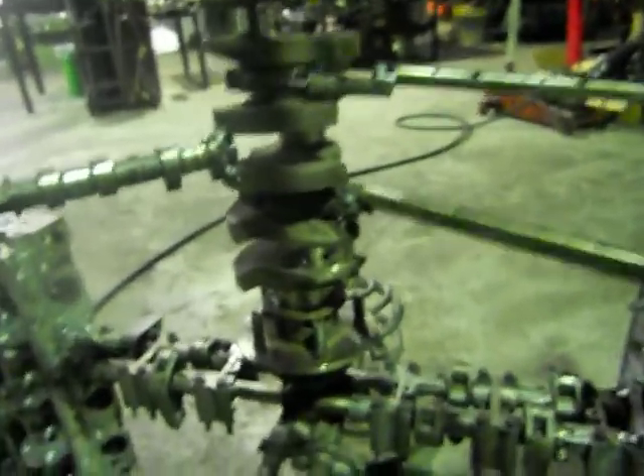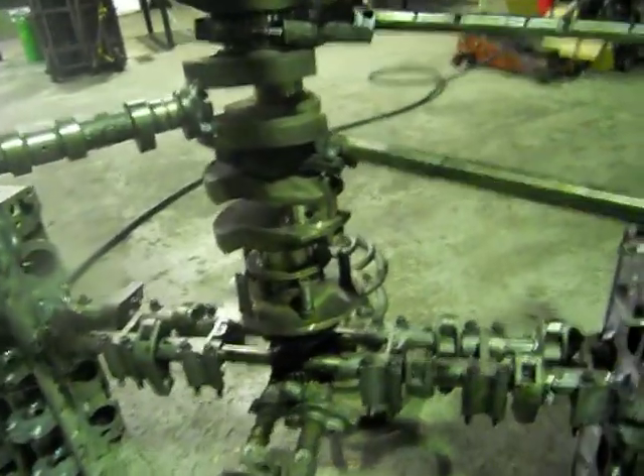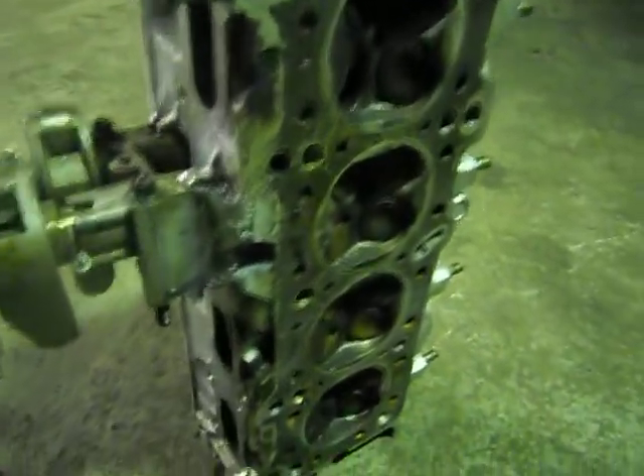Because it was bloody heavy — this thing weighs over 200 kilos I reckon, which is about 400 pounds — it started getting a bit uneasy on the springs. So I had to then run another rack gear, that's off a Falcon. All I've done is just welded a couple of caps on the heads there and she sturdies it up now. It's pretty good.